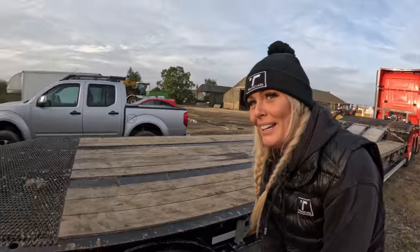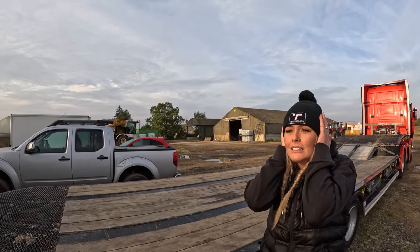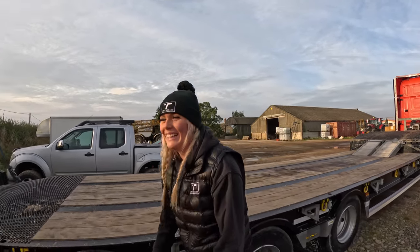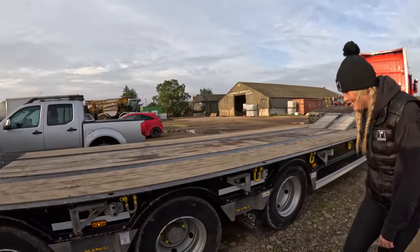And the tread depth is? The minimum tread depth on an HGV is? Well, this could go horribly wrong. 1.5. One mil all the way around. No. No. 1 mil across at least three quarters of the circumference of the tyre. Width of the tread, yeah. Right, okay. Right. Okay, so I didn't know that. Well, I did. See, that's why assessments are important.